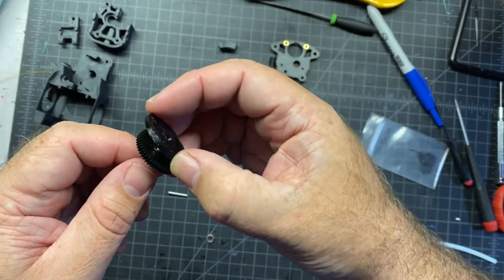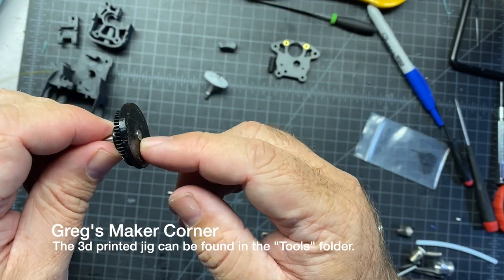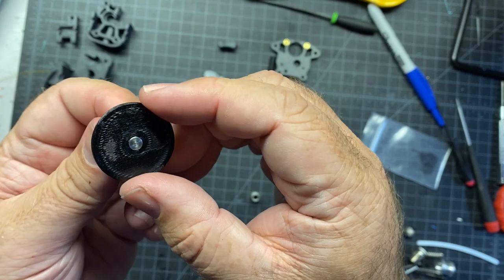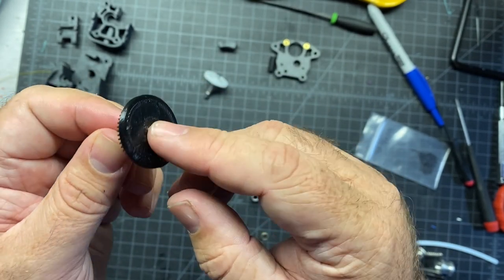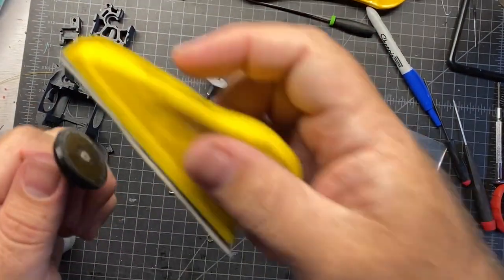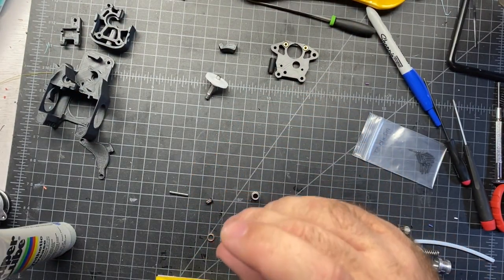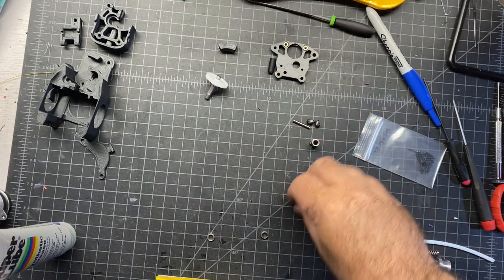This is the jig that comes as one of the parts. Basically put on the jig and then if you have anything protruding outside of that, that needs to be sanded down a little bit. It's really close, but I'm going to go ahead and sand it anyway — there's just a little bit there that needs to come off, but you want this to be less than three millimeters. So I'm using this little finger sander, just lightly sanding. You probably don't want to do this over your gears like I just did, so keep the area kind of clean.